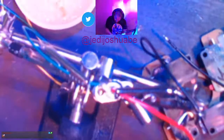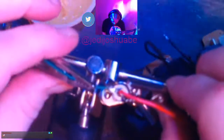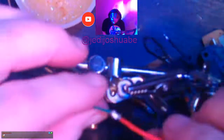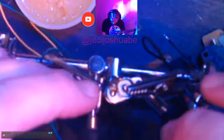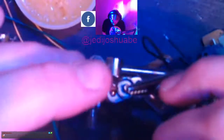Had to just kind of remind both of the wires that they are coated in a metal liquid. There we go. Boom. You see that solder? I'd give it a B. There's a little lump on the right because the wire got too hot. But that's okay. It's really, really okay. And so that's it. You want to take them out, give it the tiniest pull test, twist test, feel the heat. Yeah, see, that's a globber.